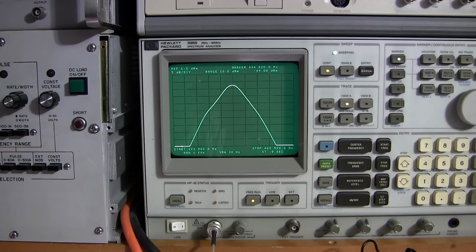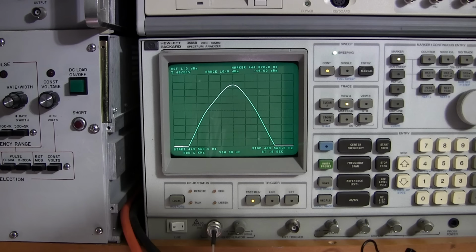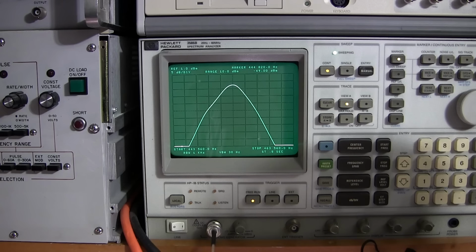So now I'm going to be adjusting one of the controls on the upper portion of the crystal box, T2. That's not poking out of the side here, but that's from the top of the receiver. Okay, so here we go. Now again, this is in the manual position. And we're just looking for maximum amplitude now. And I'm just using the screen for that. Kind of a coarse setting, really, is all we're doing.